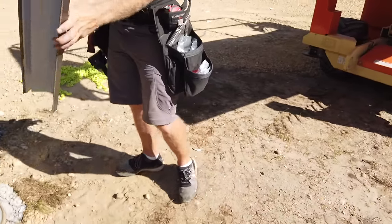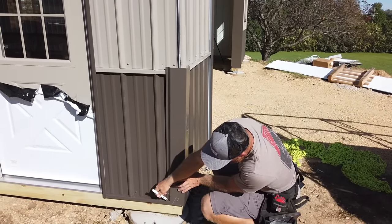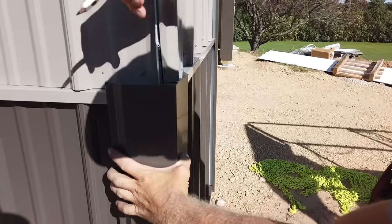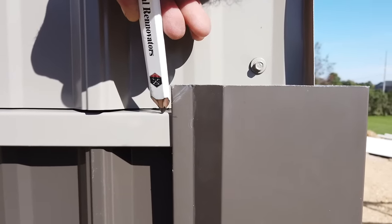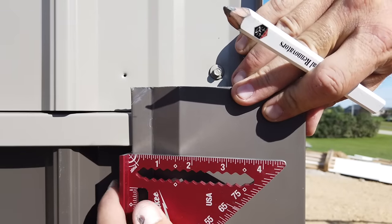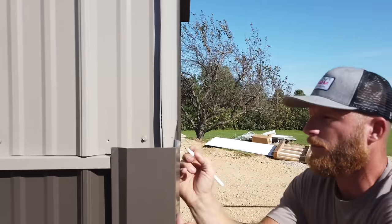So now that I have these one-inch little knockouts at the bottom, that is what's going to set right on top of my base trim like so. This is going to lap over my base trim, but then I've got this to deal with up here because it doesn't just magically work — you've got to do a little manipulation. So what I like to do is mark on the edge just underneath the top leg of my wainscote trim and then over here mark in line. If it's your first time, go ahead and set your square right on the edge. Give yourself a little mark — don't try to be too perfectly tight otherwise it's going to be a pain.